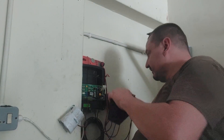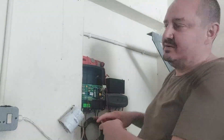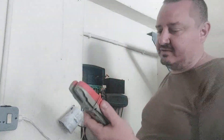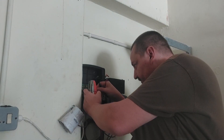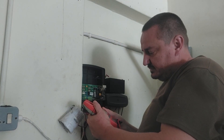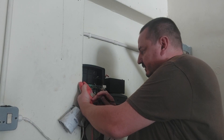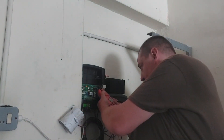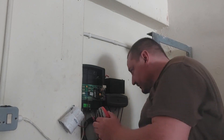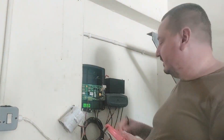We'll also just check the fuses now. For that I'll have to switch off the mains because, like I said, it's wired in South African style. There's some beeping in the background — just a UPS charging here. Let's pull the supply fuse — supply fuse is good. The battery fuse is good. The auxiliary fuse is good. Over here is the little reed switch that the magnet will activate.